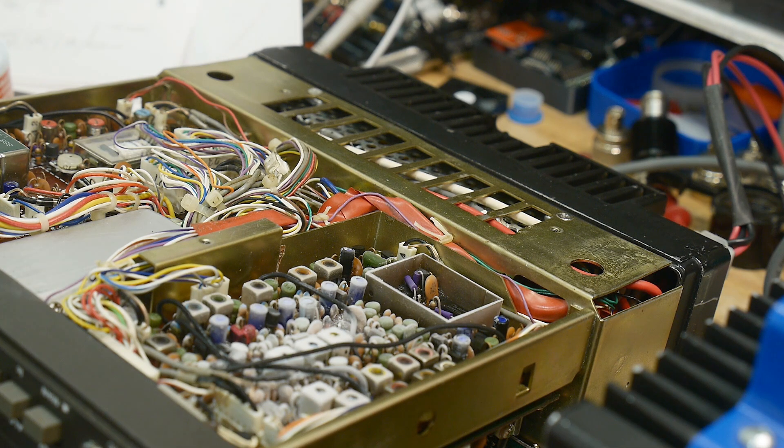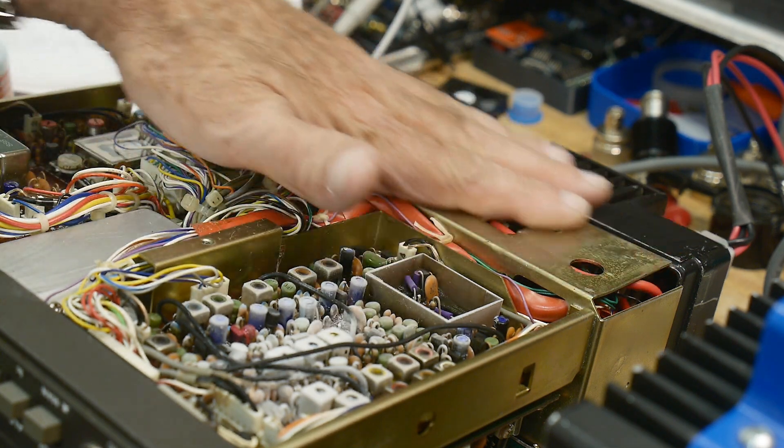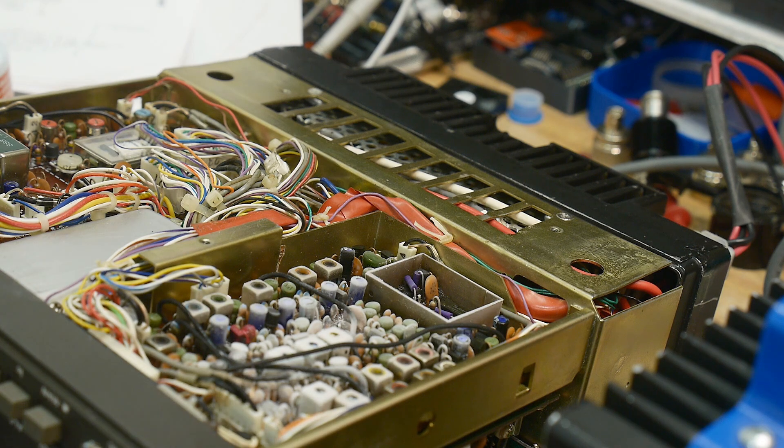In the meantime, I'm going to see if I can get this thing transmitting. Spoiler alert — it doesn't. So we need to troubleshoot that as well. I'm not quite sure what's going on yet, but I didn't get any output. I don't know if we have bad finals, bad drivers, or a bad relay — never know what goes on in these things. But that's why you want to buy these to do the troubleshooting, because that's your hobby and that's what you have fun doing. If you don't have fun doing this, don't — because it's going to be really, really frustrating.